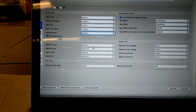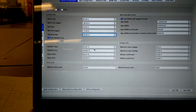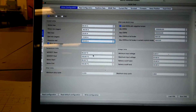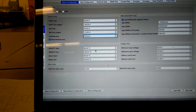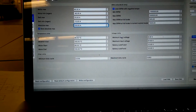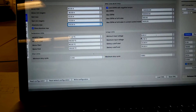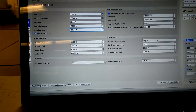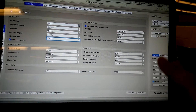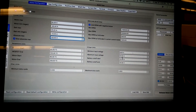I set my motor max and motor min to 80 and negative 80, battery max to 25, and battery min to 12. I've also set my voltage limits because I'm using a 6S battery — I've left my minimum to 8 volts and my maximum to 57, just so they don't get in the way of anything.